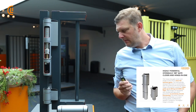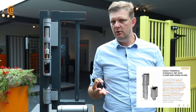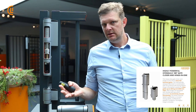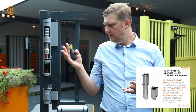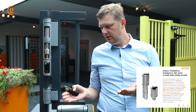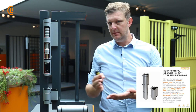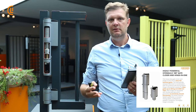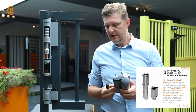Now the Mammoth HD — why the HD? We see in the market there is demand for a good gate closure for heavier gates or fully cladded gates, wooden gates. And then you're looking as well at the weight. Today with the Mammoth, as you can see it here, Mammoth and Dyno — 1.5 meter wide, 150 kg. Bearing hinge on top, Dyno on the bottom — perfect for gates like 1.5 meter wide. But what if you have a heavier gate, like 2 meter wide and 200 kg? Well, now we have the solution for that as well.